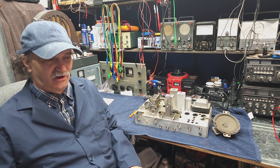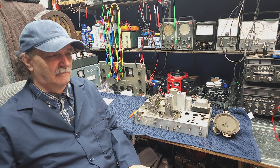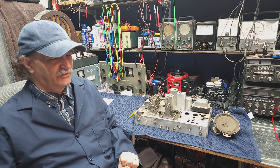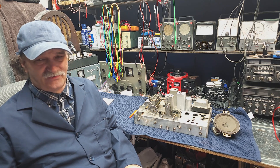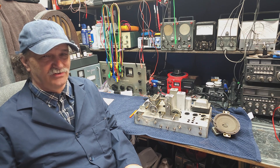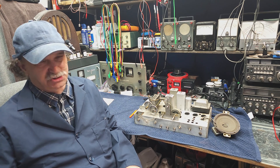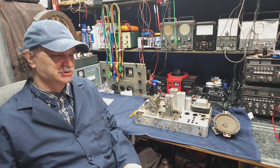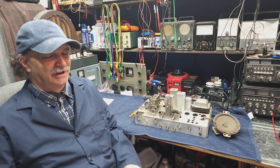We're also going to talk about which resistors usually go and which ones don't, from a load perspective. Some Halicrafters receivers I have replaced almost every resistor in. In other sets, barely one — which is really strange. Maybe it's batches of resistors from different manufacturers, or storage conditions with less moisture, or maybe the set didn't get used a lot. The world may never know.